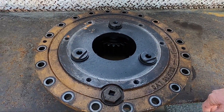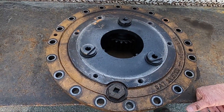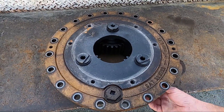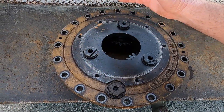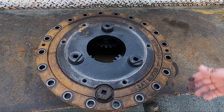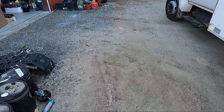It's an indicator that something's going wrong. The operator didn't notice it - he said he did notice it was a little hotter than the other one when he touched both of them the day before, but whatever. Anyway, I ruined the outer ring gear and hopefully it didn't ruin the housing. Today I've got to pull the pins out, then replace the gears and the pins, get it cleaned up, and get it ready to put back in on Monday.